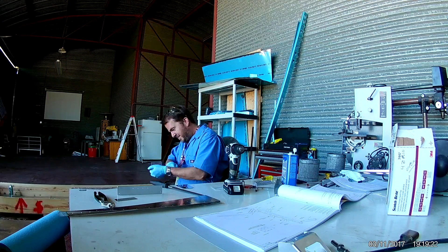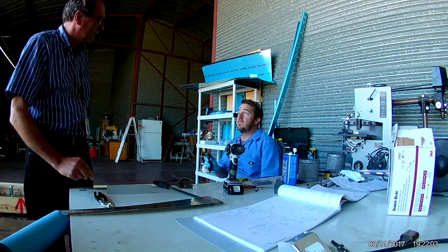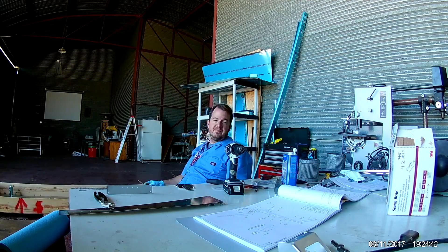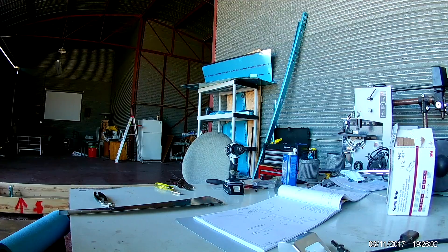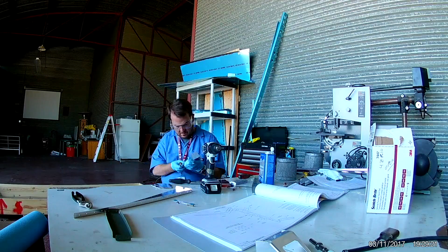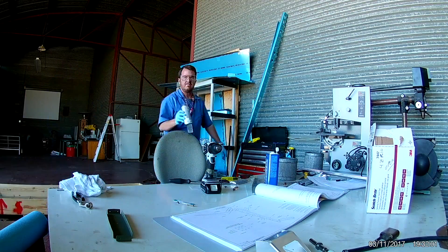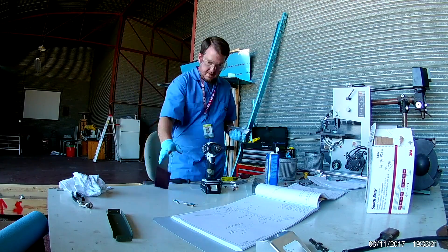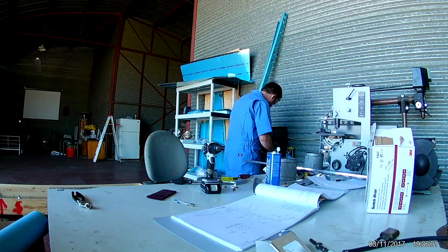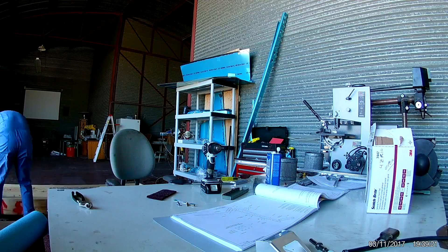The very top rib of the rudder has already been pre-dimpled for you — or rather the back part of it has been pre-dimpled. You will need a specialized drill size: you'll need a number 33. The plans call for a 33. I believe it was originally a number 40 hole — or possibly a number 44 that's been opened up but never really been final drilled. So yeah, you'll need a number 33.